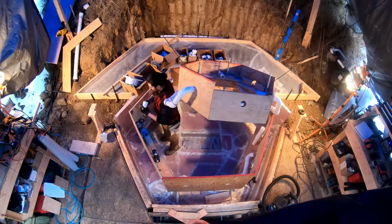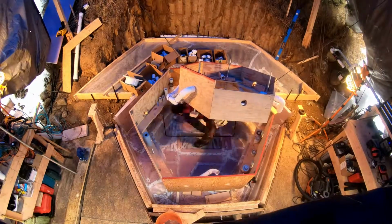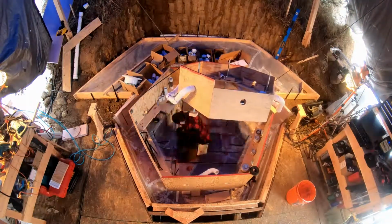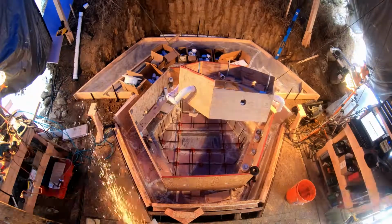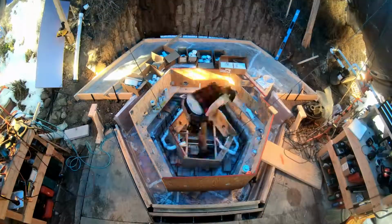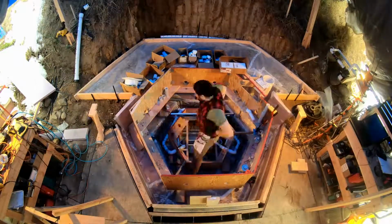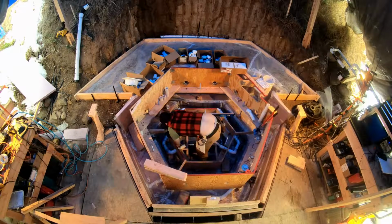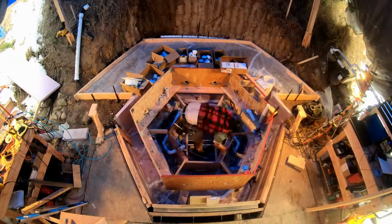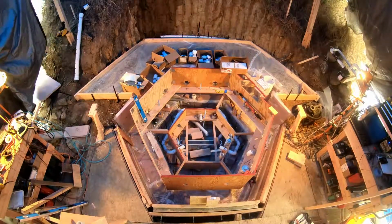The hoist was really helpful as I was able to fit the drain plumbing and then pull the form out to build the lower rebar grid. And then I could lower it back to check for fit and clearance. For the most part, I'm using 1/2-inch rebar, which is number 4, on a 12-inch grid. After the lower rebar was in place, I used spacer blocks to center the lower form inside the upper form and finish up the drain plumbing and the light niche conduit runs.